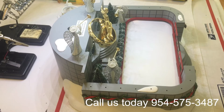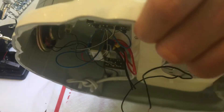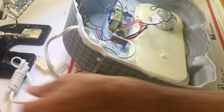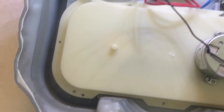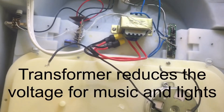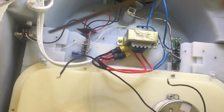The first thing you will notice is that we have the unit out of the box and on the table. It's a very simple unit to repair. The base is not removable, so we have already taken our X-Acto knife and cut out the film on the bottom of the unit. The white cord brings in 110-120 volts into the unit, and the step-down transformer reduces the voltage for the lights and also for the sound. The motor however is 110-120 volts and is wired pre-transformer.